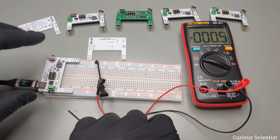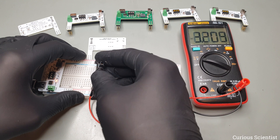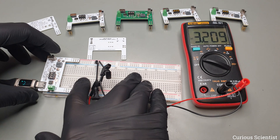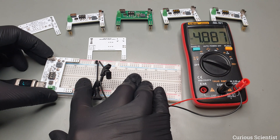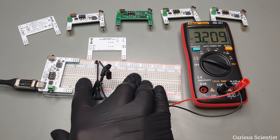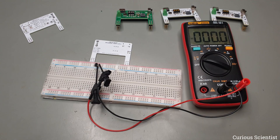This is within an acceptable deviation, but the real reason behind this deviation is that instead of the 57.6kΩ resistor, I used 56kΩ. I'm almost 100% convinced that if I used the correct value, the output voltage would be spot on. This is further corroborated when I switch to 5V, because the output only becomes 4.8V instead of 5V. I will get the proper resistor in the future and test it.